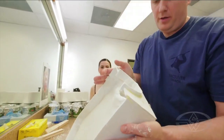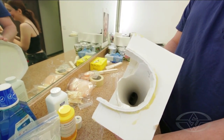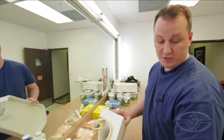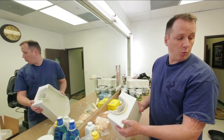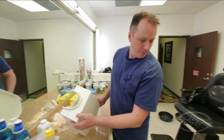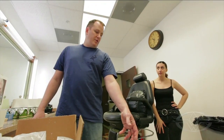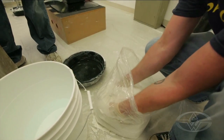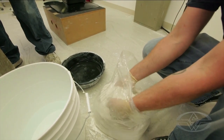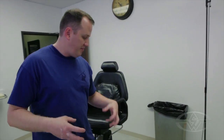In this negative space we're going to pour the plaster. Cleave is ready to start mixing up the HydraCal — we're going to use white HydraCal, which is a very hard white plaster. It expands slightly and that helps compensate for the slight shrinkage in the alginate. Cleave is getting ready to pour the plaster into the water. The first thing you want to do once you get your plaster is fluff it up so that it gets a much more light, flowery consistency, then slowly sift it into water.